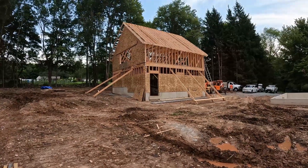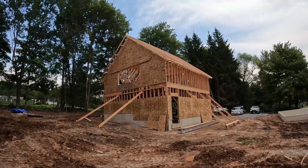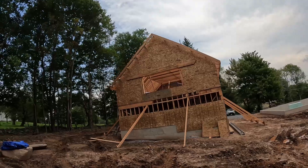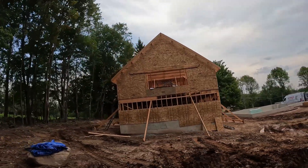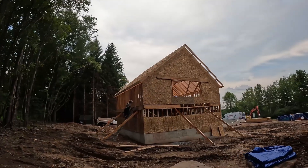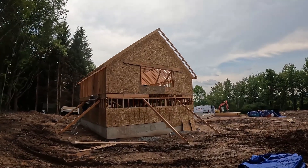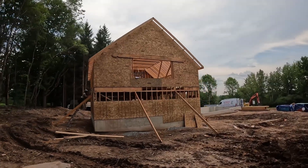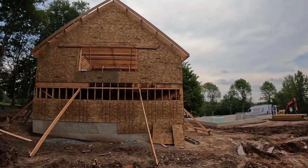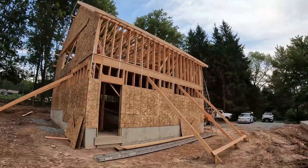Alright guys, we're starting to get cleaned up for the day. We just finished the fascia and rake all around this building. We put two guys up in the work platform and a couple guys on extension ladders to get everything nailed off. Pretty good progress today. You can see down all four sides — even the front — everything is complete. This is a 10 pitch on this roof, so putting the plywood, shingles, weather watch, and deck armor is not going to be fun. Super steep — we've got to be super careful. We do have our harnesses, which obviously we'll need.